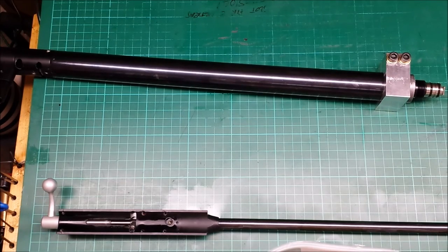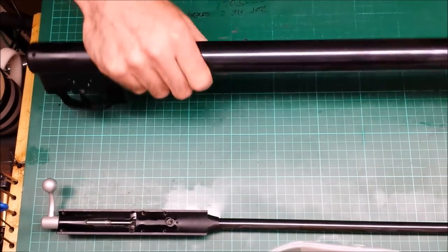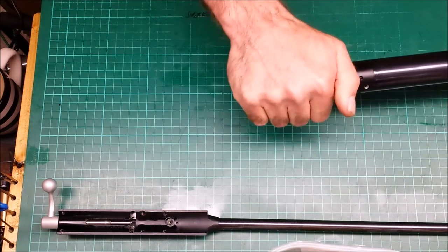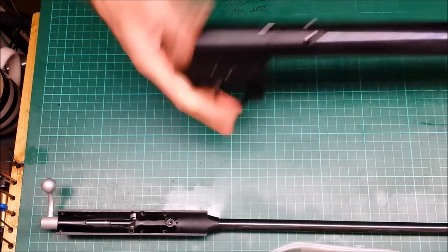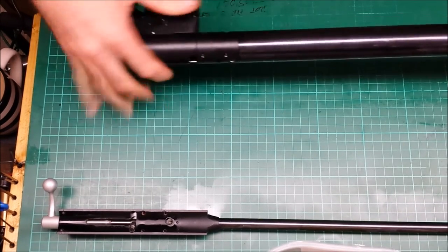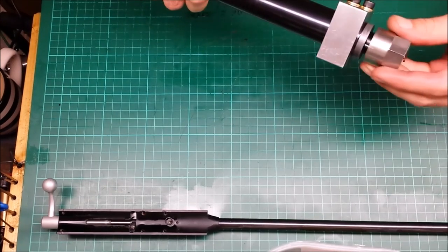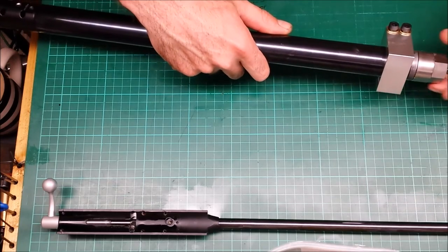There you go. You can then go about — you can either clamp this in a vise, because obviously it's square, or you can put it in a Workmate or some other thing. And then you can go and undo this end. The same can be done the other way — you could put this on here and then use the other tool that I sell for the Air Arms, which fits in here, to undo this end while you're holding this end in a vise or something else.